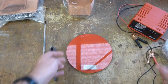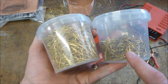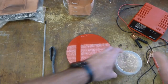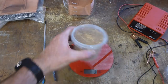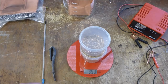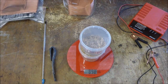We've got about half a kilo of pins here — two types. Both are wire wrap pins: a male pin and a female pin from the same plug, which are D-50 type headers. I'll run them together because the hassle of filtering the sulfuric acid for just half a batch isn't worth it. Including the plastic it looks like about 900 grams, so a little bit less without the containers. I'll do a proper weigh just before I get going.